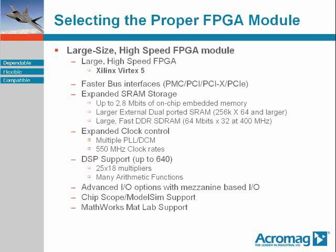They will support some combination of your basic digital I/O types — TTL, RS422, 485, LVDS — and make possible the processing of high speed analog. They will have considerable memory support external to the FPGA, but on the FPGA module itself: perhaps 256K by 64-bit and larger SRAM for post-processed data, DDR RAM of 64 megabits by 32 for pre-processed data, and high speed on-FPGA device block RAM up to 2.8 megabits.